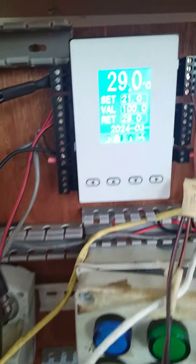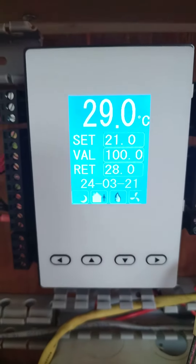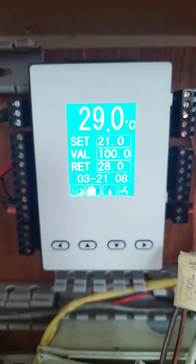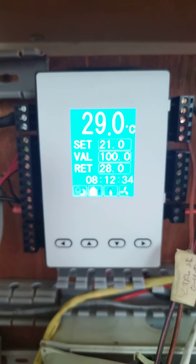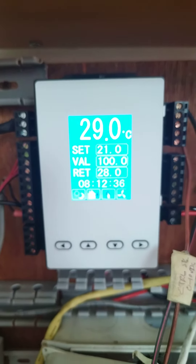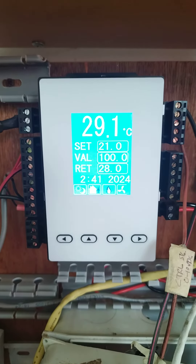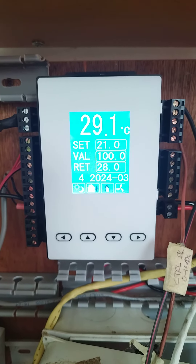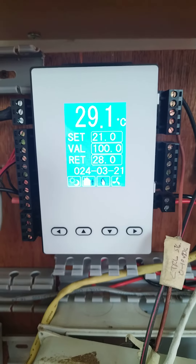This is a good response with our T3OEM controller. I've just used proportional here — I did not implement any integral part of the PID control. I will try to adjust it. It will be better if you can see the actual response of the control during actual operation. Thank you guys for watching. Bye for now.